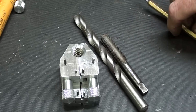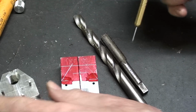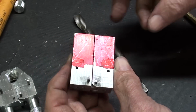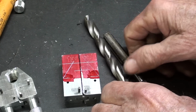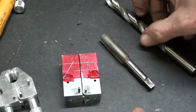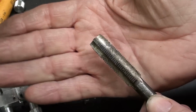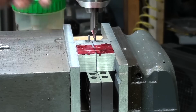Once I get this set up in the milling machine vise, I will be drilling and tapping this hole. Again, that is the point there, and I'm going to lay this out with the digital readout when I get to the milling machine, and I will use a pilot hole of about 1/4 inch, and then 29/64 is the tap drill size for the 1/2-20 Unified National Fine plug tap, which I will power tap. So let's step over to the J head.